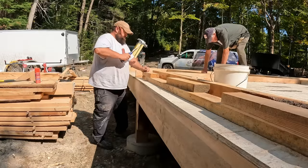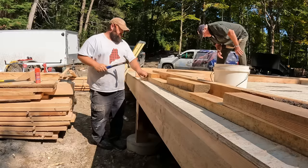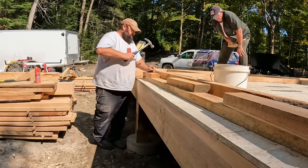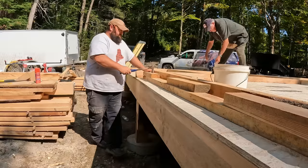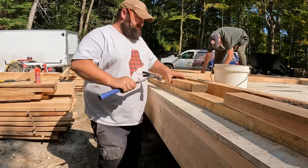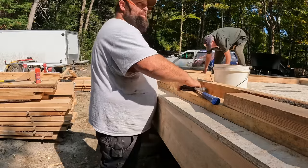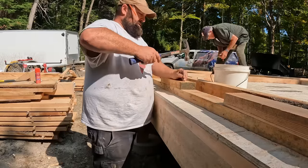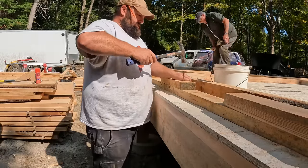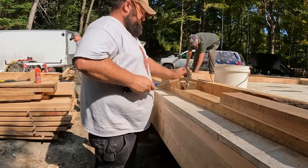We are starting the framing process. Donnie has me building headers and corners. This particular corner is a double on studs with cripples in between. I think he wants to snap a line with you, Stevie. Okay. We just use some blocks to pad that out so that way on the interior we'll have a nailer, and it strengthens up the corners.